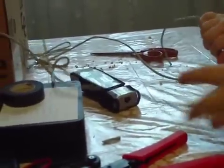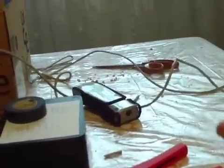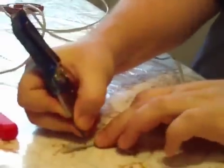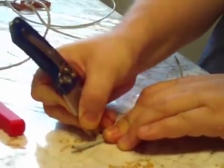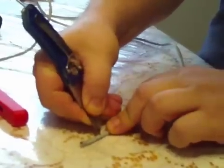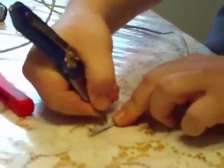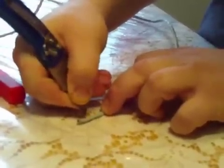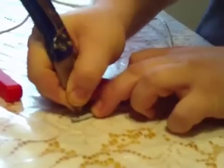To start with, you need to strip the insulation jacket back on the wire. So you select the length or piece that you need and cut it from the cable. You can use crimpers, you can use strippers — a lot of times our Category 5e crimpers will have strippers on them. My personal favorite is just a small razor blade or utility knife. I'm just going to slit an opening here in the insulation jacket, and I'll try to hold it at an angle so you can see. You just want to be careful that you don't slice any of the insulation off the wires inside.